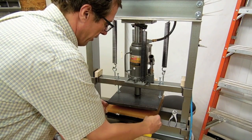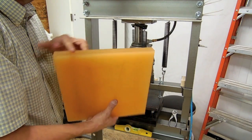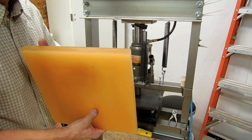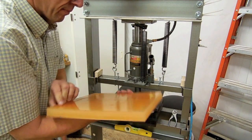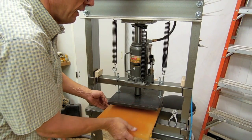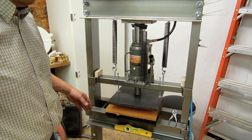I have two pieces of rubber here. The top piece is polyurethane rubber from McMaster-Carr, and underneath is a piece of neoprene rubber. I was trying different hardnesses — this polyurethane, which is what's normally recommended, I believe was hardness 60. The neoprene I tried was a 30, which is too soft. The 60 was really good, but I think 55 is ideal — what a lot of people use.